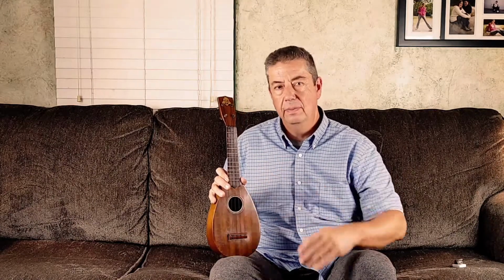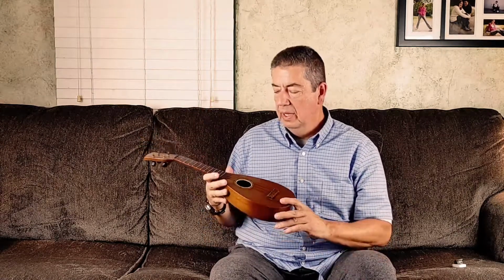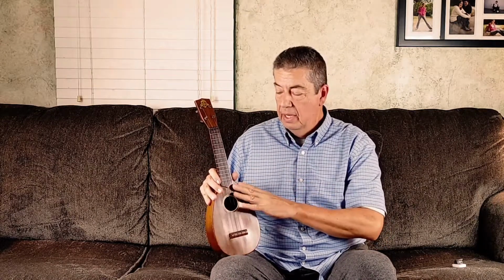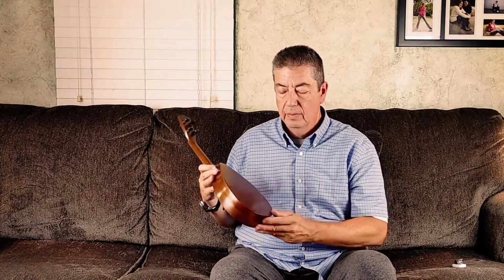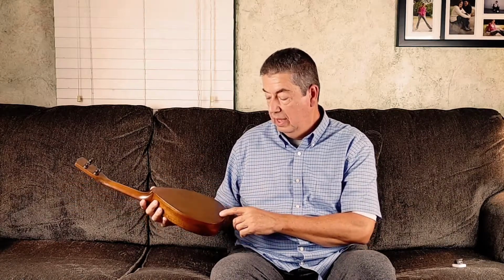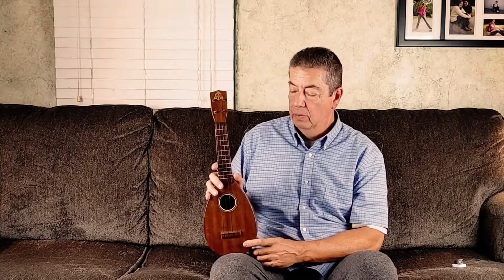You find it in the oil-based artist paint section. It's used as a thinner for that and for cleaning. But it's easier to get the lighter fluid, and very, very carefully go over it, and that way it doesn't hurt the finish that is there. When I fixed this back here, I did go through some of the finish, and there's a spot where the wood got a little bit redder. I didn't mind that because the repair I had to do on it is actually part of the history of this instrument now. Yet I wanted to preserve the finish that was there.